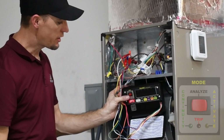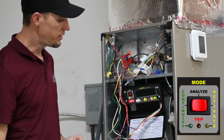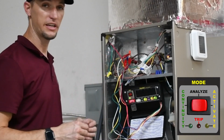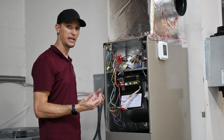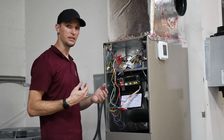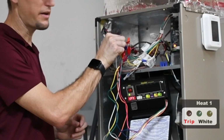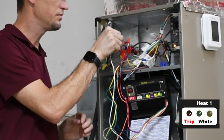One thing we are going to go ahead and test now is a continuity check. So in other words, all the wires that I have connected up, these are showing that these wires are connected to something and it is getting signal back. So in these cases where you have wire breaks, this is a good indicator of at least letting you know that everything's solid and everything's connected. So if I take, let's say, the white wire off, you'll see there's no connection there that it's sensing.